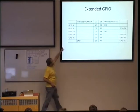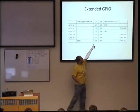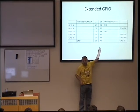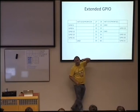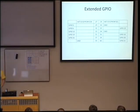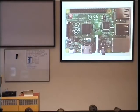Of course, if you see the name, it's clear, but if you see a number, it can be the number of the pin on the connector, or it can be the number of the pin on the chip. So be careful about that. And there is a very nice tool I will try to show you on the internet where you click the pin and it shows you all names and all functions which this pin can have.